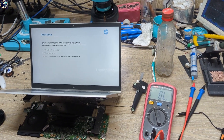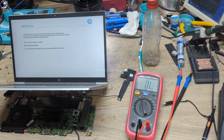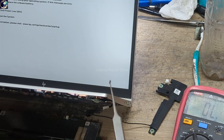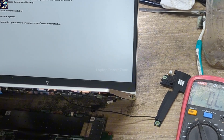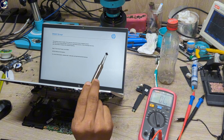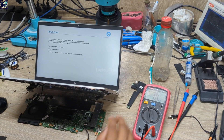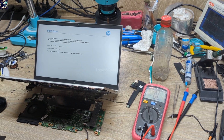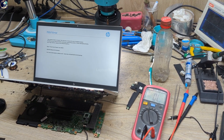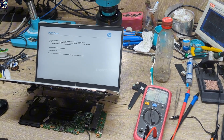To summarize: we found this IC shorted to ground and replaced it from a Lenovo T490 motherboard. Then we found an N-channel MOSFET also shorted to ground and replaced that as well, and the board is back to life again. I hope you all enjoyed this video. If you liked it, please hit the subscribe button and press the bell icon. Thank you so much — I'll see you soon, bye-bye.